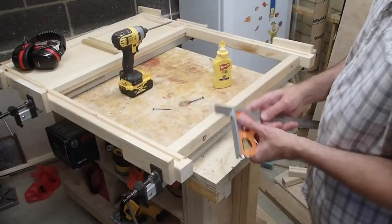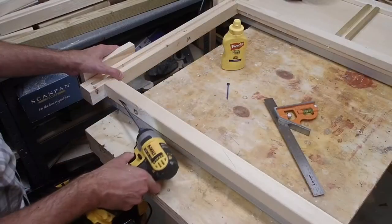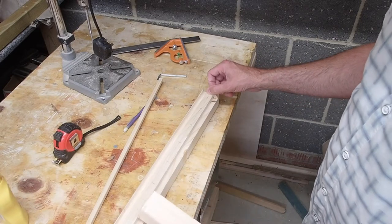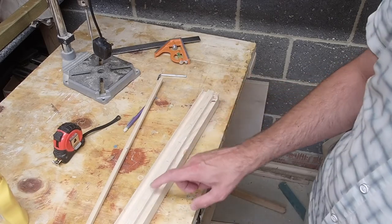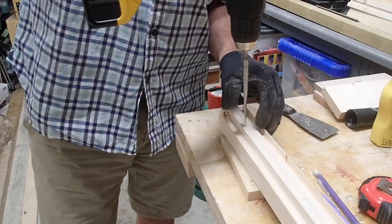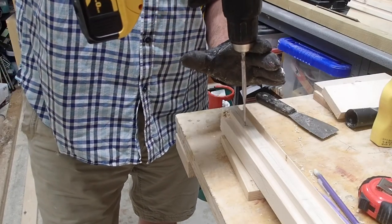I've got the adjustable squares set up at 4.5cm. So to account for the drainage holes, I just put a line on this point and to here on the center line, and 5 equal spaces on both sides. And to drill the holes, I'm just using a 16mm bit, place it on the center of the dot, going down at first, and then slightly tilting it.